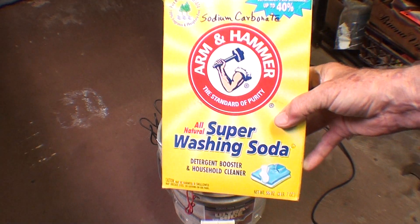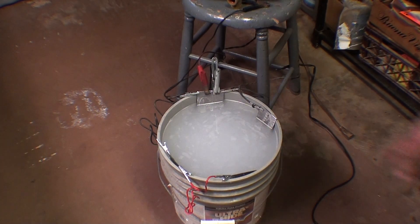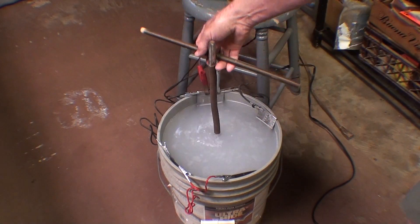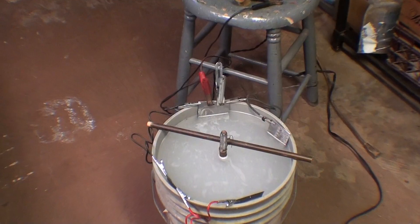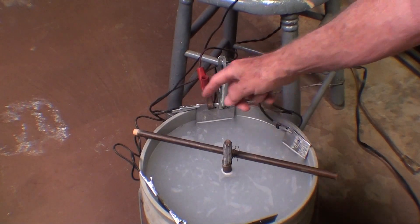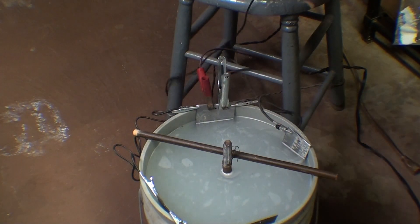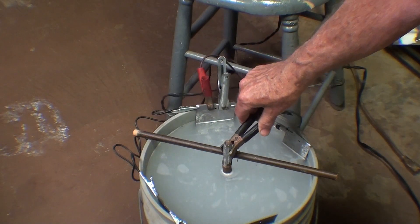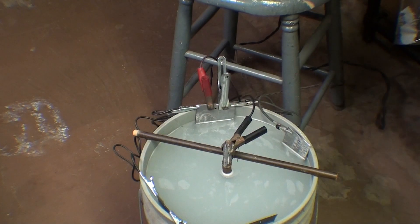I may have misspoken - it's super washing soda, not baking soda, that I have in the water. I used warm water simply because I was trying to get this washing soda to dissolve; it was so clumpy I had to break it up with a sledgehammer. Next time I'll go down to Kroger and get a new box. But that's all stirred up, and here's the wrench - I'm going to immerse that. Positive is on the anode, and again they're hooked together in a daisy chain. Make sure the work doesn't touch the anodes. You need to make your connections before you plug it in so you don't have any sparks in case there's hydrogen gas. Safety first.